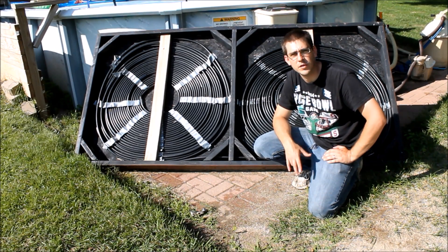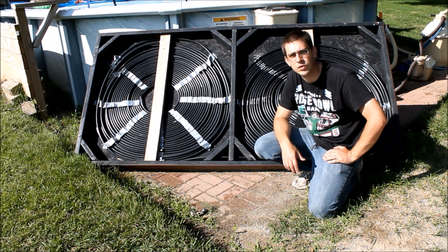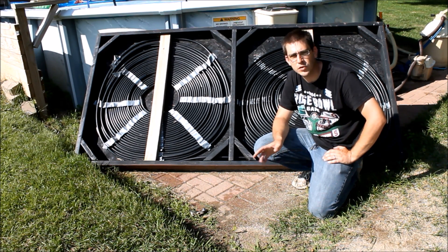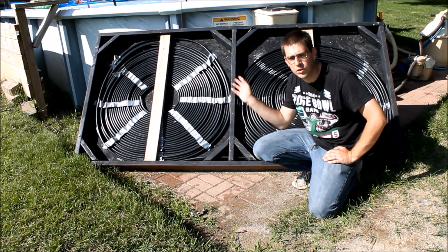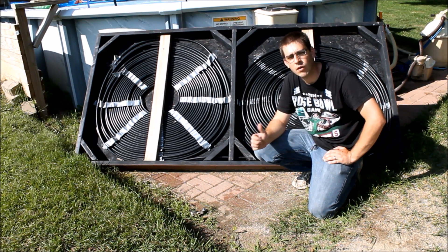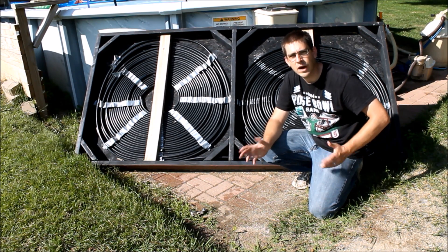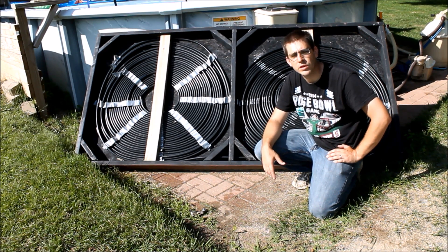This is SSL Family at Adler's Simple Suburban Living. What I wanted to show you today was the solar heater that I built for the pool. Very similar to a lot of other ideas out there on YouTube. I put mine into a 4x8 casing made out of 2x4s and plywood. I'll also show you my diverter — how I'm diverting water from the pool pump directly through the pool heater — and give you some quick statistics on how it runs, how it heats the pool, and how I feel they should be used.